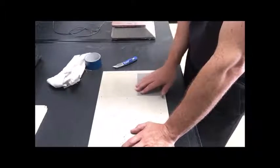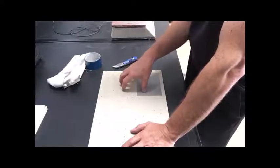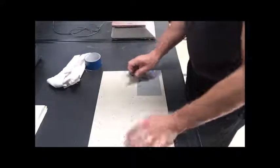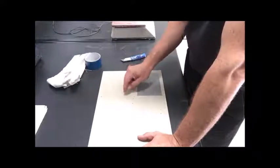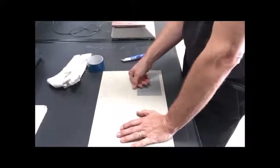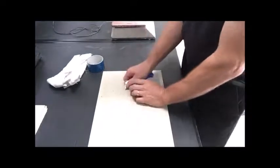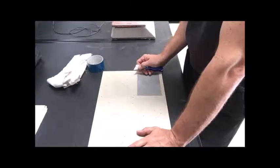The coatings are only about 100 microns each, so not particularly thick, and they'll give us an indicator as soon as we've done the crosshatch whether we've got adhesion or not. There is a proper standard for doing a crosshatch test - in basic terms we're looking to do three scores approximately three millimeters apart in both directions. Then using tape - I think the official method - you stick the tape down and pull it off to see whether it comes off. If it does, it's obviously not good; but if it does stick, I still like to pry at it and see how much effort it takes to come off.